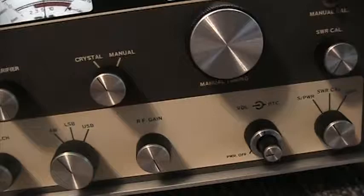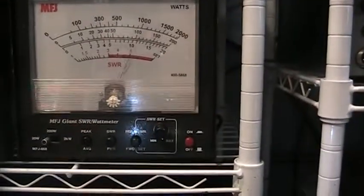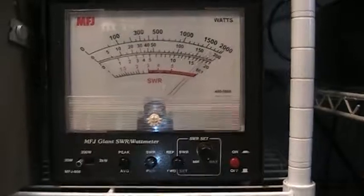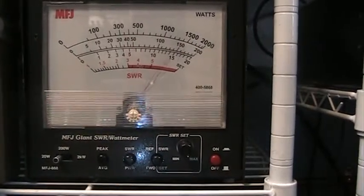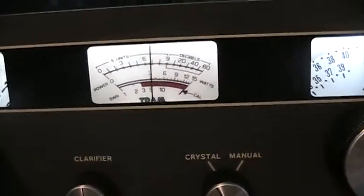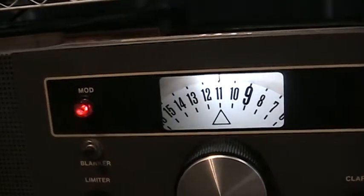Let's try it again — had to turn down the 398. We're listening now, on peak audio. You can see how sensitive this radio is — it picks up any background noise. We're using an amplified mic, and this radio does go better with a non-amplified one, but I didn't have one handy. Just keying — about four watts, swinging about 20 on peak.